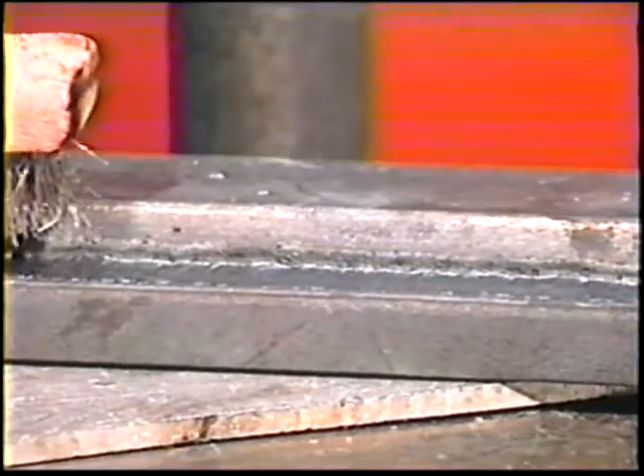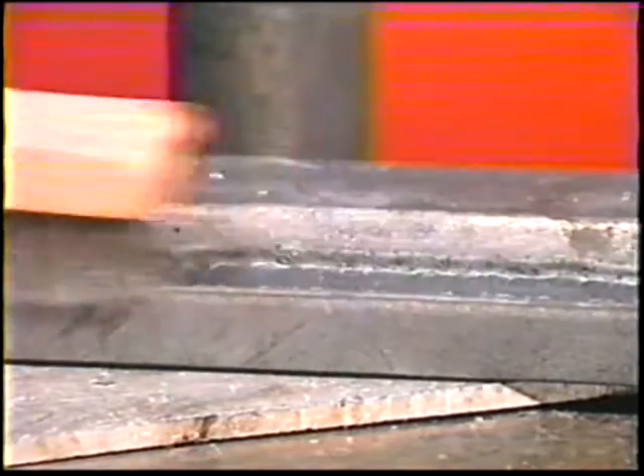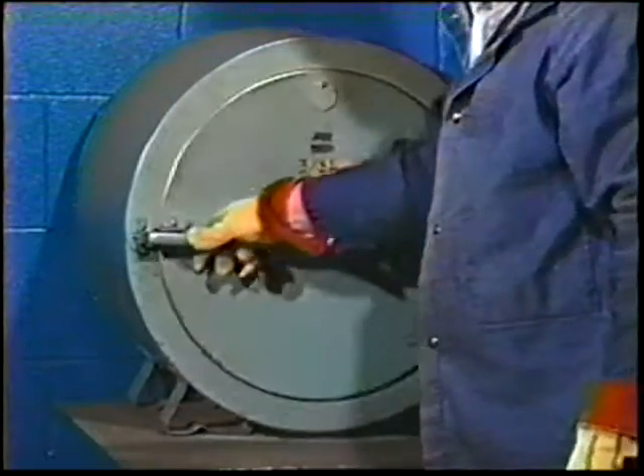In review, the main precautions to remember for using low hydrogen electrodes are: maintain a short arc length, never weld with a whipping motion or in a downhill direction with multiple pass joints. Always clean the slag completely off after each pass is deposited, and keep the electrodes dry.